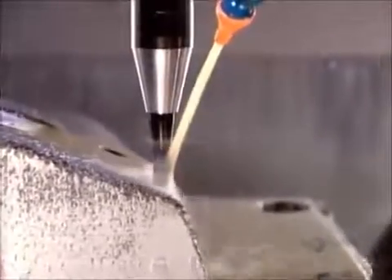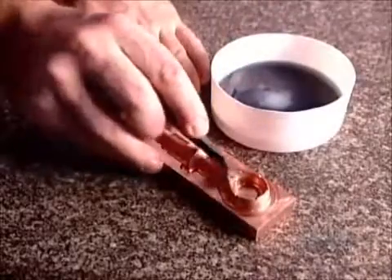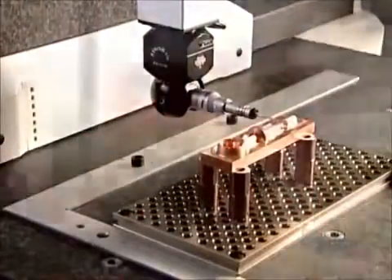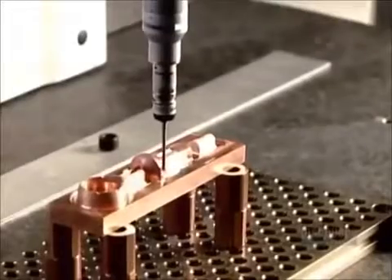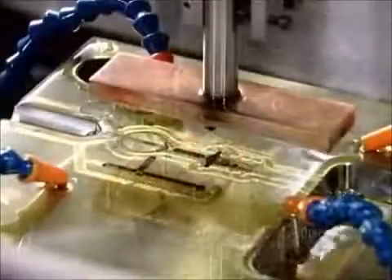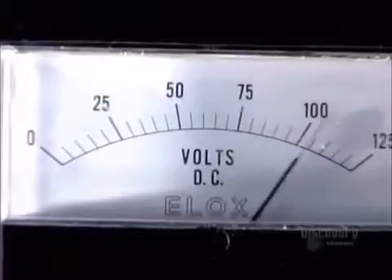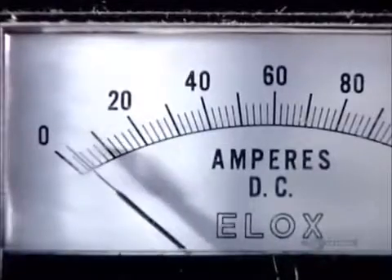From here, most mold components go on to a second tooling machine, especially if they have some fine detailing that the CNC machine isn't capable of carving. The second machine is outfitted with a copper electrode in the shape of the plastic part — in this case a snowmobile oil gauge. After polishing the electrode to ensure flawless casting, they use a sophisticated measuring device to verify the dimensions. The electrode goes face-down on the second tooling machine, called the EDM.